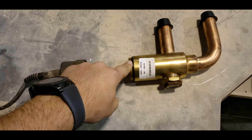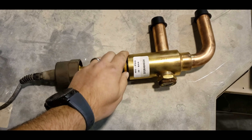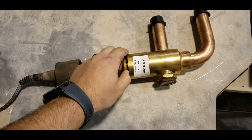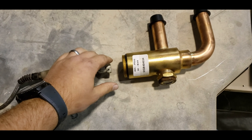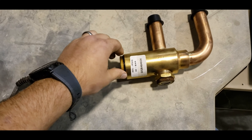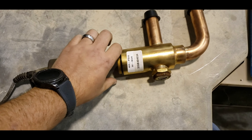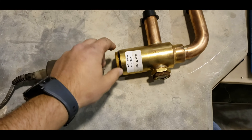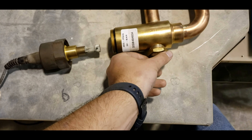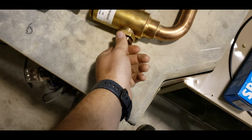The critical things to know if you're going to do a rebuild on one of these EXVs like this: you would definitely want to replace this O-ring here. Just take a small screwdriver and put it up underneath it and it'll pop off. You want to remove it evenly and then slide the new one on evenly. If you get it at a cockeyed angle and it doesn't go on even, you can stretch that O-ring and you may have trouble getting it to seal back properly.